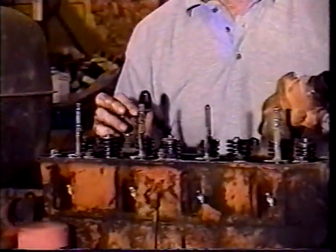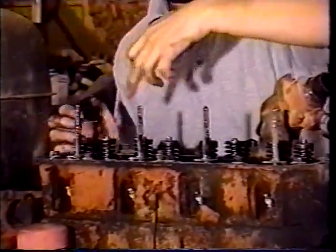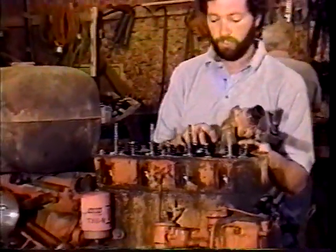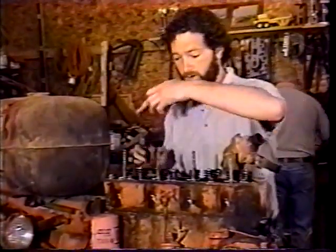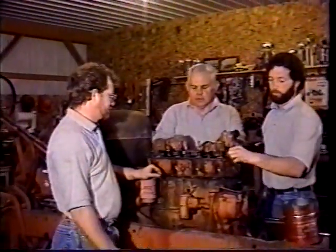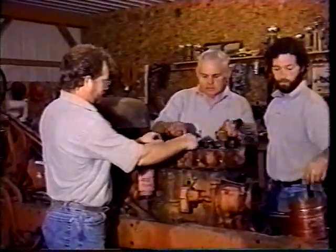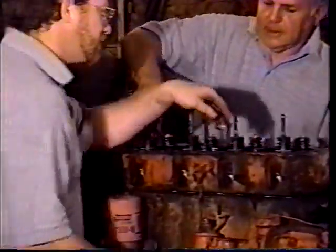And after that point, now we're ready to take all the head bolts off. There's a row of them here and a row of them along here. These ones up here, you'll have to use a wrench to get off. The socket won't fit in there, and the rest of them we can get off with the socket. We've loosened up all the head bolts. They all got to come out. Let that one come out. And put this back here.